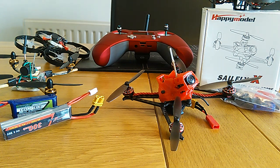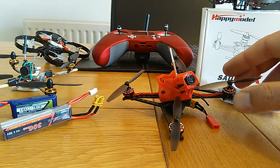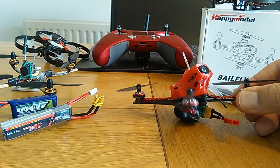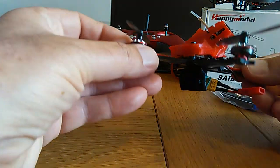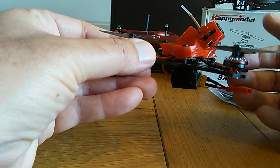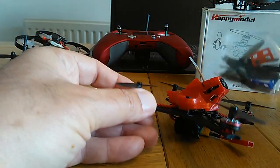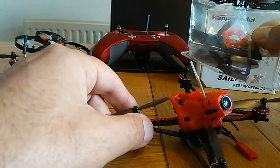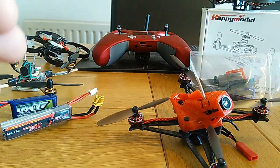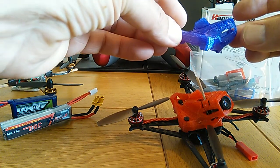And obviously it's very cheap. Banggood has it for around £60, $80 or something like that. What you get is good. It's an all-in-one flight controller, which handles 3S and 5-6 amps, 1102 motors, 8,500 kV, and these props. Get spare props. Lots of spare props in there. Screwdriver, prop removal tool, and a couple of battery holders, and an extra canopy.